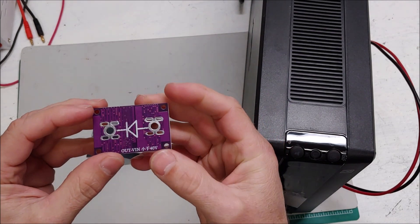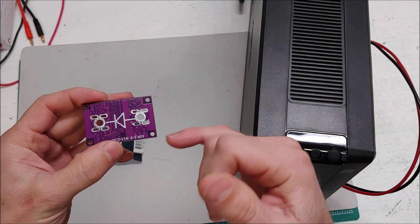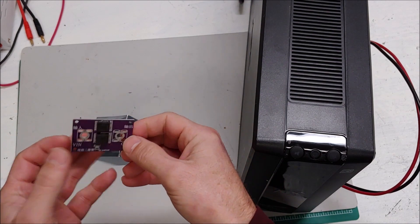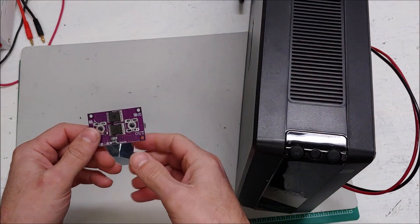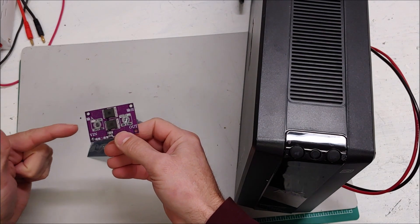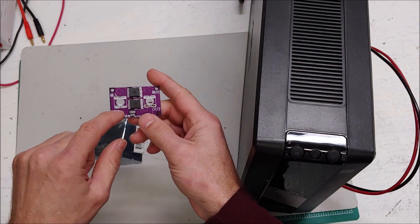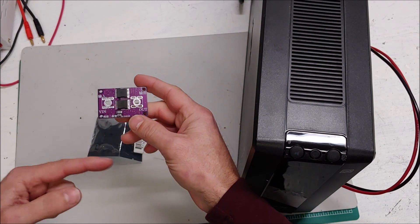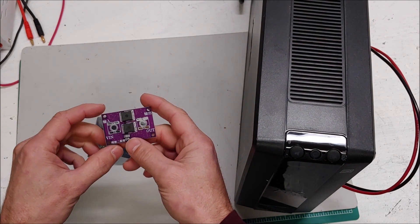You can see it has got V-in and V-out, so the voltage is going to flow this way, which makes sense. So technically if my battery is over here and my UPS is over here, we want the battery to come in and come out here. According to the instructions, you only have to connect the positive legs to this — the negative leg you just join without running it through the blocking diode.